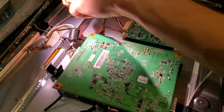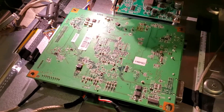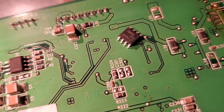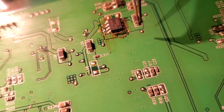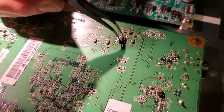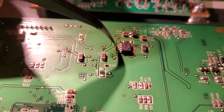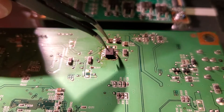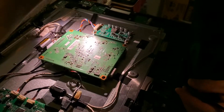To install the new transistor, I pull it fresh off the reel. There's a little circle on one of the corners, and that circle lines up with the dot on the board. So little circle, little dot — get it in the right direction and line up the pins as best you can. The most important pin is the one that's separated — the circuit board is connected internally on the other pins, but this one is pretty separated, so you want that one to be the most well-positioned.